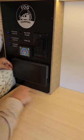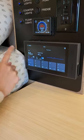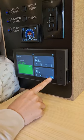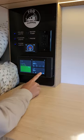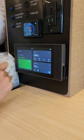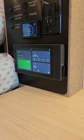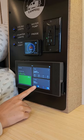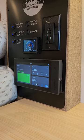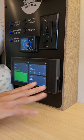So this is an EcoFlow touch screen. Press the power button here to turn on your screen. This is your output — and this is your full system. Right now all of your power is going into your lights, counter lights, water pump, and fridge. To turn on your outlets, to turn on the inverter, just press the AC and then your outlets will turn on. Just remember, when you're done using your outlets and you don't have anything plugged in, turn off the AC, because that will continuously draw power from your battery, which you don't want. Don't touch the DC because that will completely shut off your system. And that's all you need to know about this — just turn off the screen when done.